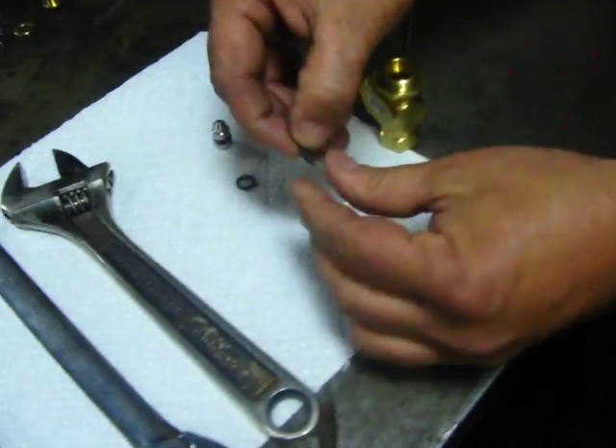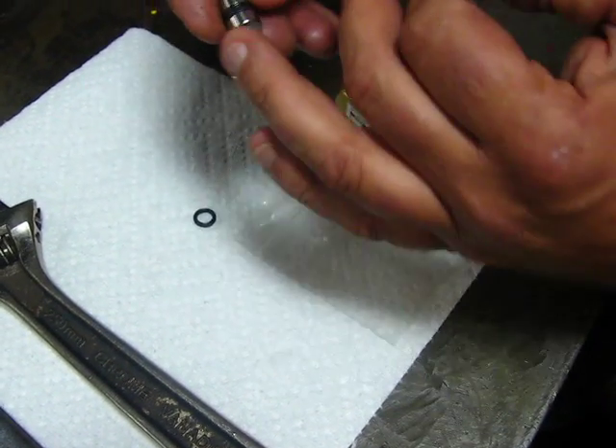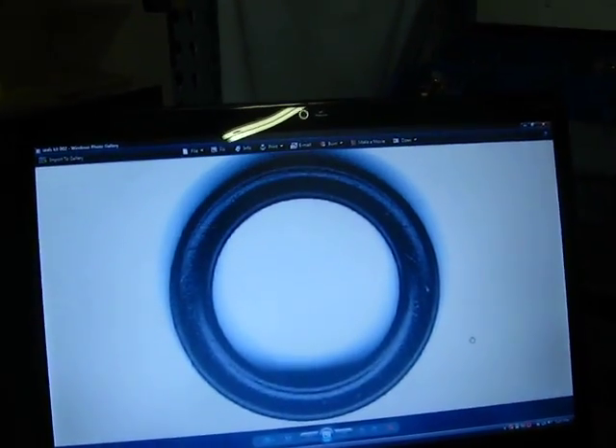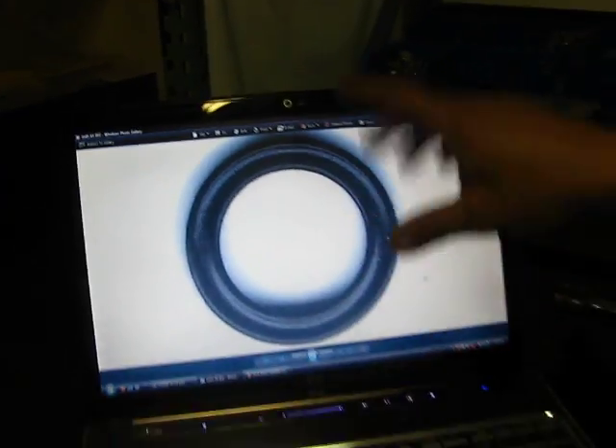You'll be able to place it in that groove — this seal goes towards the flat area. Now, this is the one that helps the pump pressurize. There's a unique shape to it: the inner edges are higher, the centers are lower, and then the outer edges are higher again. If you don't have this seal and cannot find it from your local supplier, you can get away temporarily with a 7mm ID, 11mm OD O-ring, or worse case a 6mm ID, 10mm OD O-ring as a temporary fix while we send you the proper set of seals for the correct replacement.